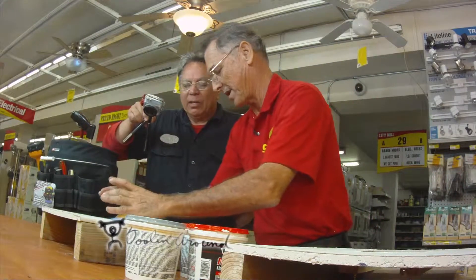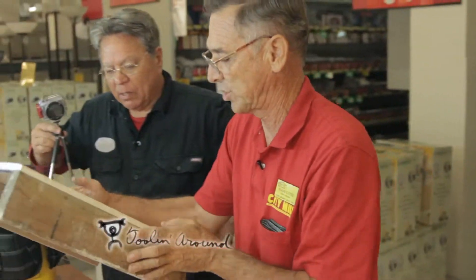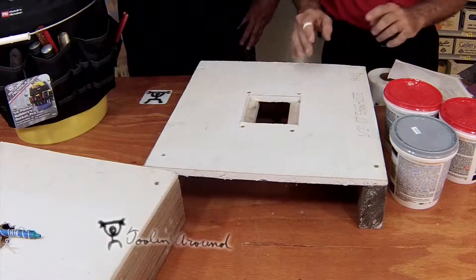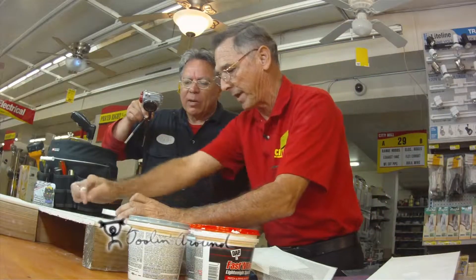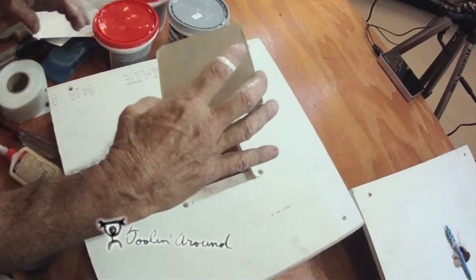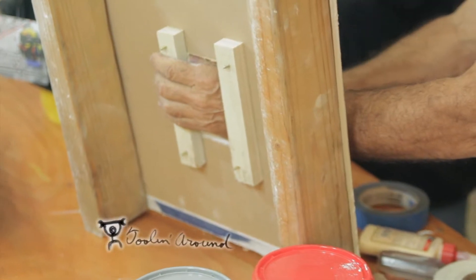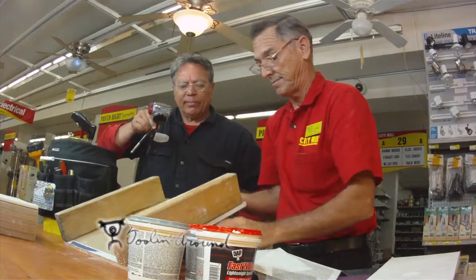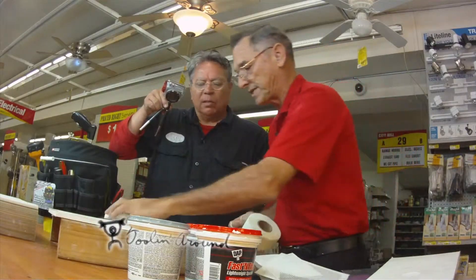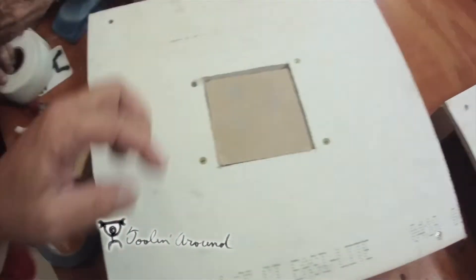If the hole is so big, naturally you can have a giant hole — in that case, this method is not recommended. What is recommended is that you cut out something larger than the hole, make a trace, cut a piece the same size, and use a cleat. You stick your hand inside and put the cleat in. After this piece is inserted, you have to go put your tape, and since it's not perfectly flush, you've got to fill those gaps.